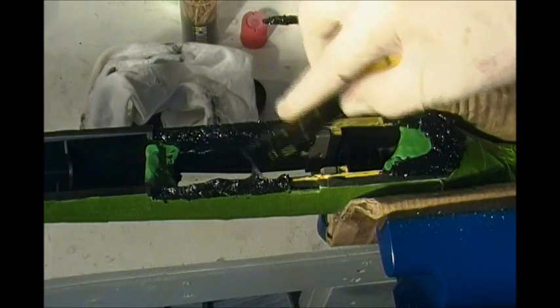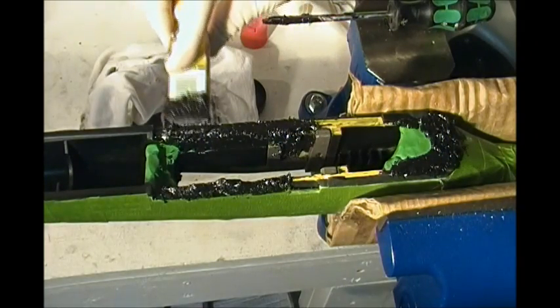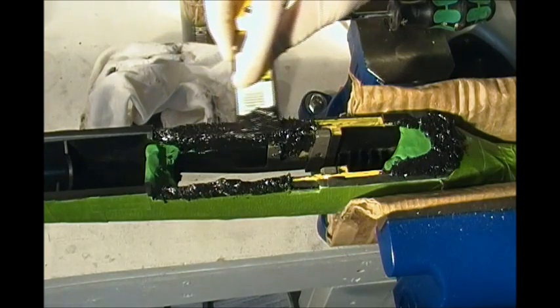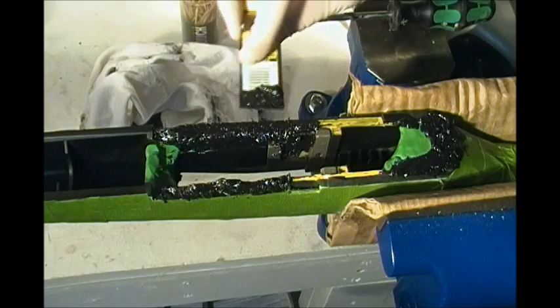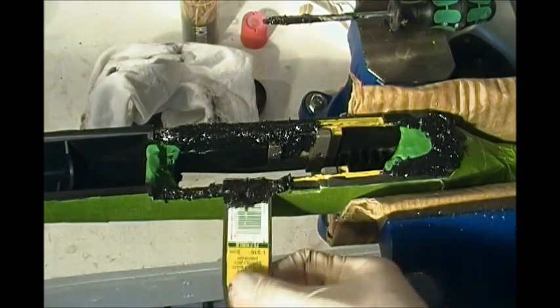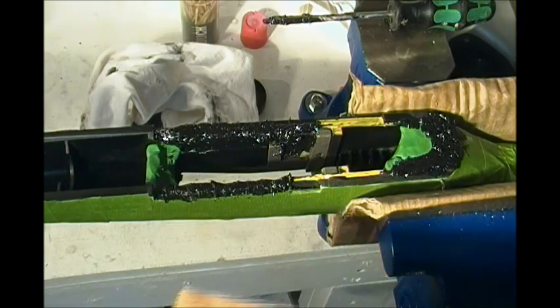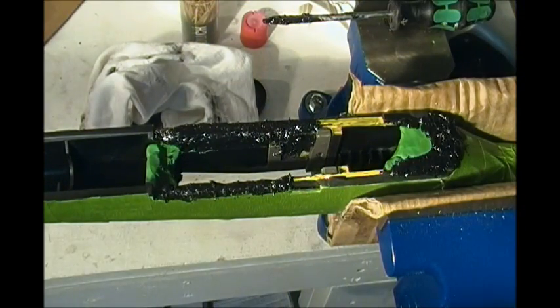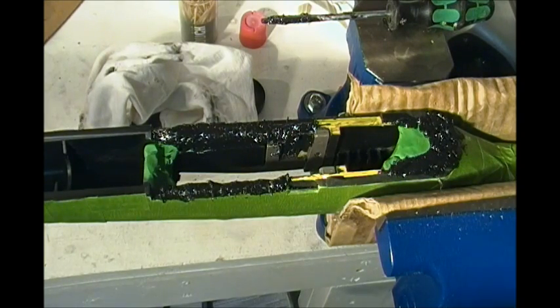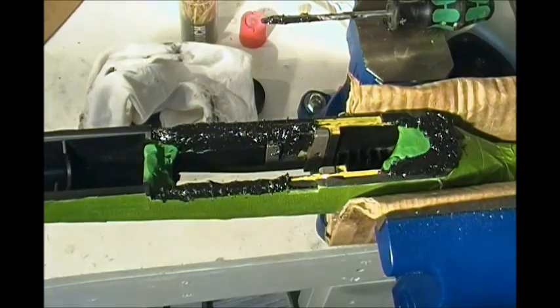I always leave it slightly proud — a little high — so you know you're going to have full contact with your receiver, and that's what it's all about. Getting good contact with your receiver and keeping the edges nice and square. That looks about right. Now the moment of truth — you always have a little bit extra. So we get our action, which we've cleaned up with plasticine and all that, and give it a light spritz of WD-40.